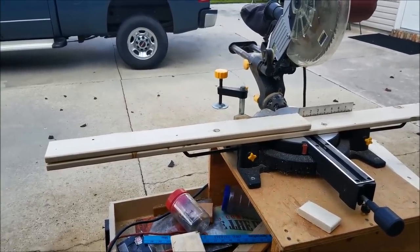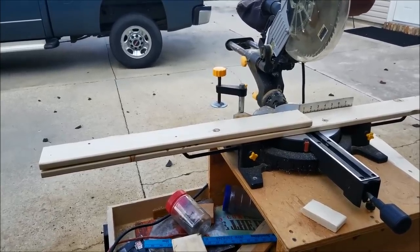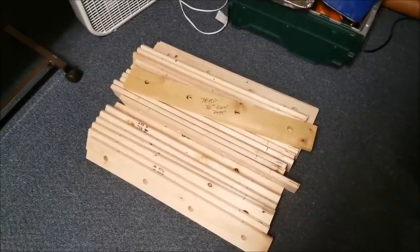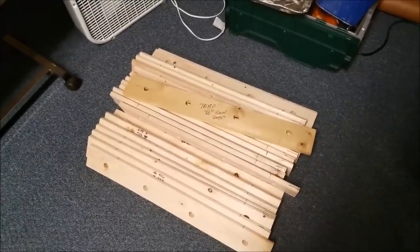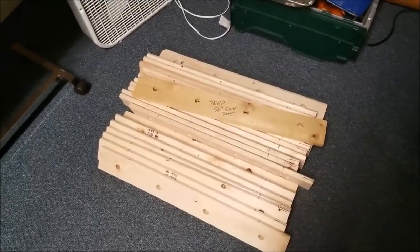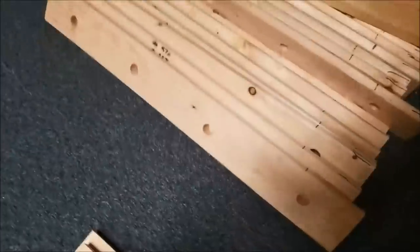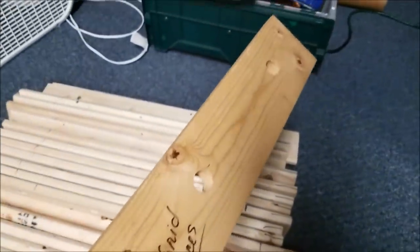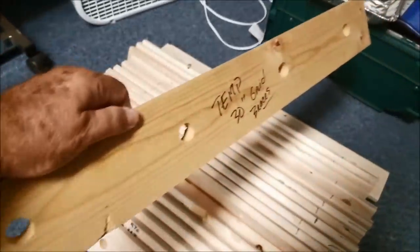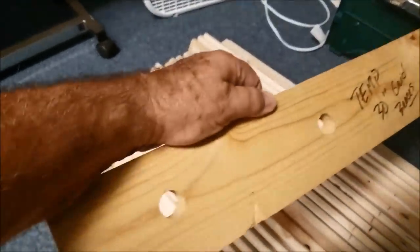On top of this we're only putting a piece of plywood that's two feet wide, and we'll explain that as we go along. We missed a part yesterday when we were cutting — the next step after cutting was punching the holes. This was done with an electric drill, not a battery-operated drill, because this takes a little bit of power to get this done quickly. Each one of these — and this is the long-time template, built this whole railroad with this template — shows you where the holes go in each board. These are three-quarter inch holes done with a spade bit. We clamped three together and did them three at a time; the last one we did four.